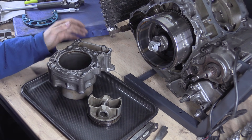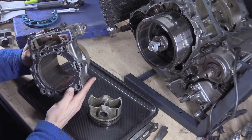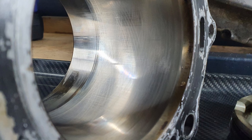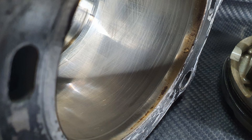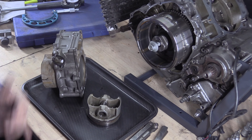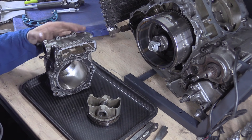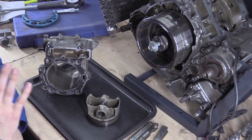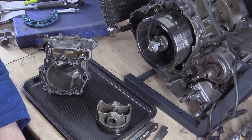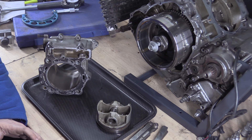I've got some pictures of the cylinder. It's covered in grime — it's been blasted and stuff, but it's not in the best condition. It's still got grime and crap on it. Don't grab a rag and just stick it in here and clean out the cylinder. Just leave it. You don't touch it until you've absolutely cleaned the exterior. And even then you don't really need to touch it.